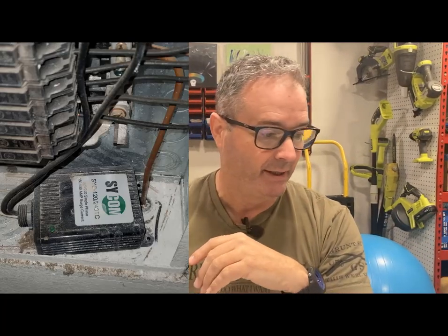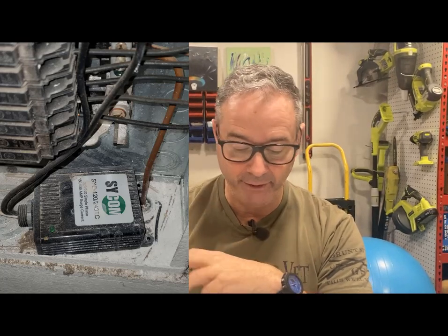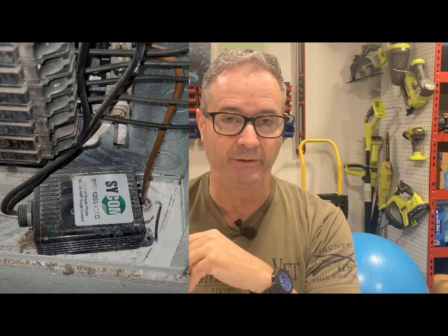The Sycom came up from hidden units — I was doing a home inspection, and I'll share this picture. I've opened so many panels with the surge protector thrown into the bottom, usually double-tapped or double-lugged onto a breaker. One big problem: how is the homeowner supposed to know whether their surge protector is working if it's buried behind a dead front? They can't. The only exception is the Siemens FS140, which has an audible alarm when it's been damaged. But I still wouldn't recommend burying it in the panel.